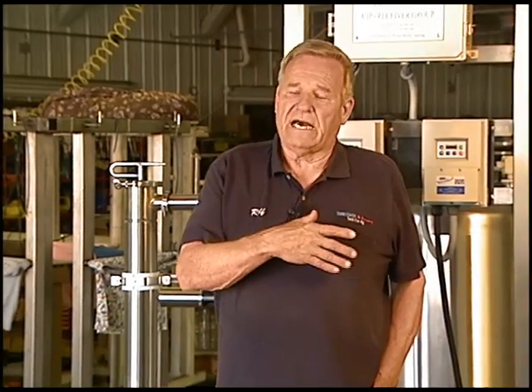It's way more aggressive than a vacuum system. It works faster and it cleans extremely well. This particular group is built to support a double-thirty, rather large parlour — it's going to Albany, New York. The normal group is about half the size. To support the wash system for a double-thirty parlour, it's a rather small receiver. We are estimating we'll be washing up with maybe 100 gallons per cycle, versus 180 to 240 gallons for a vacuum wash system. Assuming 100 gallons times three cycles, that is 300 gallons — only half the wash water you would have in a vacuum wash system.